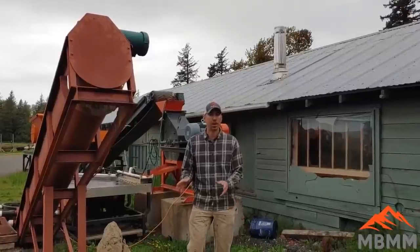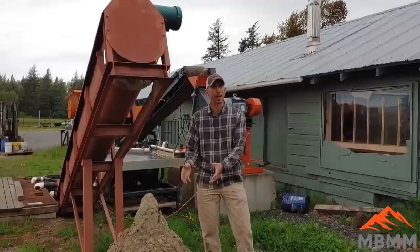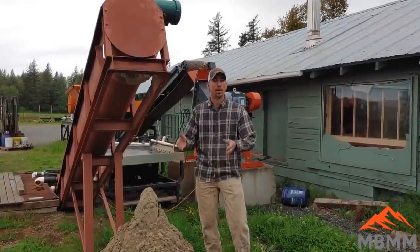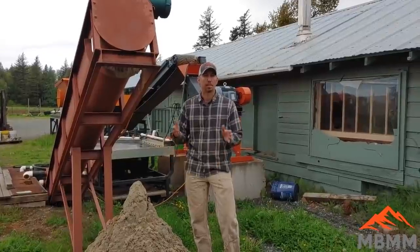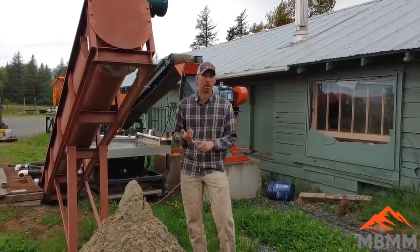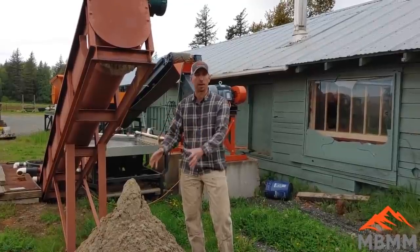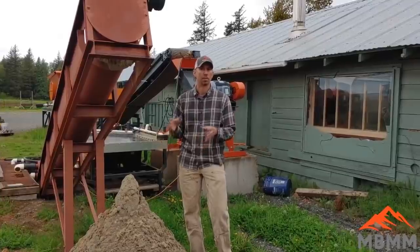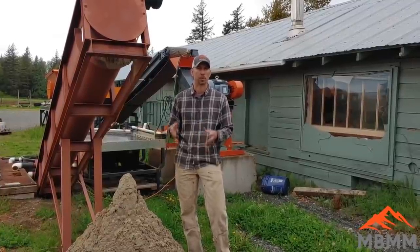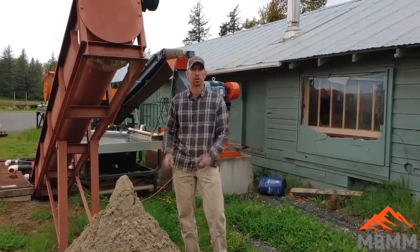And so the question we have to ask is, right now we're recovering 75%. We can recover 90% if we regrind this, but is it profitable to do so to get that extra 15%? And by introducing a ball mill, which has a very low cost of maintenance and wear, and if you have a large enough resource through the tailings, it probably makes sense to go after that $100 to $150 worth of recoverable gold a ton if you can keep the system moving and have the resource to justify it.